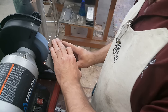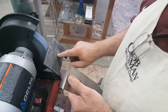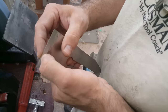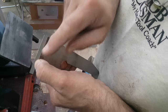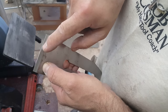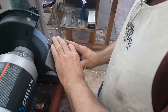If I'm re-grinding just to shorten my secondary bevel — that's my primary reason for redoing this main bevel — as your secondary bevel gets wider and wider with successive sharpenings on the hand stones, it means you're having to move too much material. So I go in and I shorten this tiny secondary bevel until it's just a little whisper of a thing, and then I can go back to my regular honing, which really speeds things up.